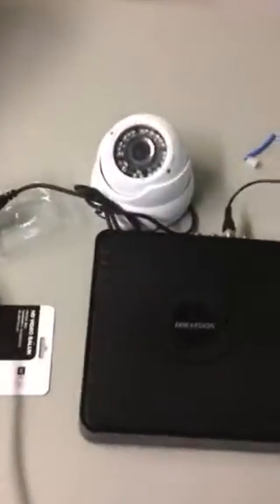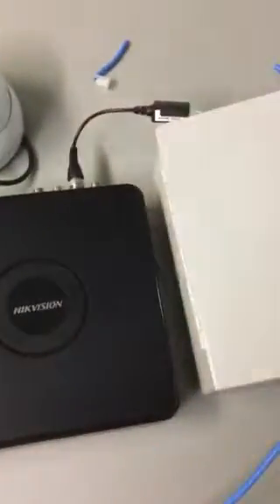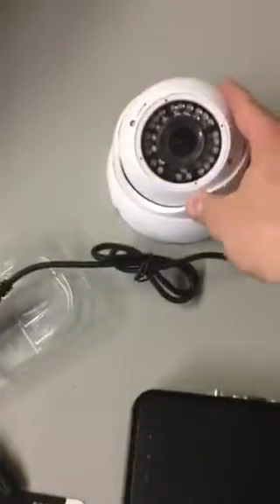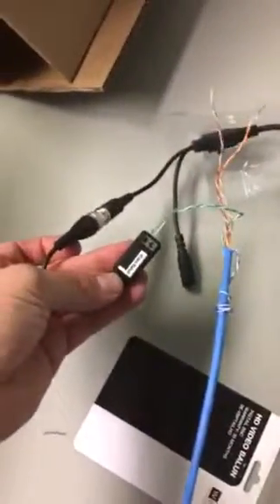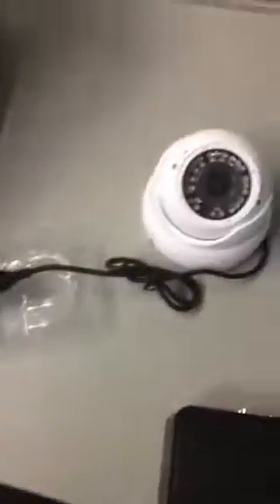The purpose of this video is to show you how I connected a camera DVR power supply through the CAT5 wire. Please mind that this is an analog camera, not an IP camera, and we can still utilize CAT5 cable for that. In order to do this, we will require an add-on called a balun — a video balun — on both ends: on the end of the camera and on the end of the actual recorder or DVR.